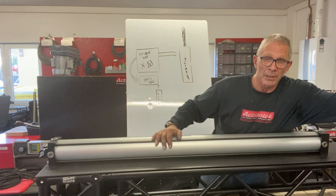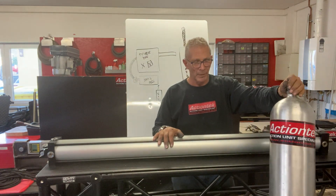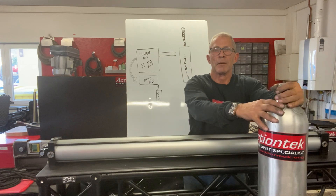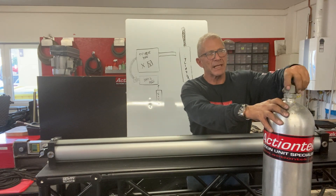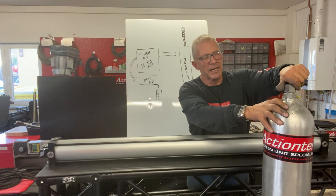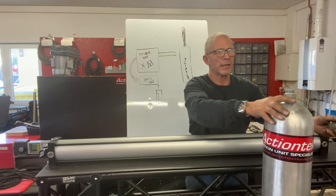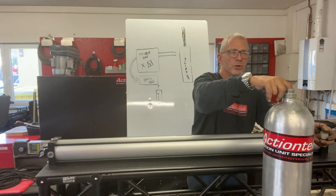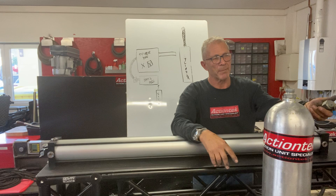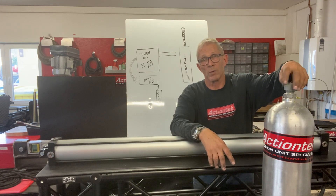Here's an example of an accumulator — this is an 11-liter aluminum bottle. Because my system runs off a slightly different plumbing system, this has been punched out past the M20 thread that's normally inside, and it has a 1G — also known as 1-inch BSPP, British straight pipe thread. You can basically read a newspaper through it — it's huge. That also goes into the reason why my ratchets work the way they do and why they're so efficient.